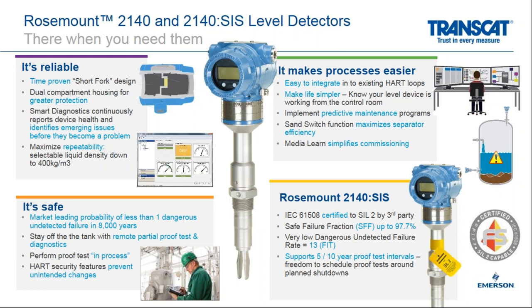With sand detection, you'll have 4 different settings and you can adjust for different densities and different compactness of the solids that you're going to experience at the bottom of a vessel. You'll get those changes from dry to wet, and you can also set up discrete points. For example, 8 or 16 milliamps, or 4 or 20 milliamps, or whatever the user decides to use on their control system. So when we go from a dry condition to a wet sediment condition, we'll go from 8 milliamps to 16 milliamps.